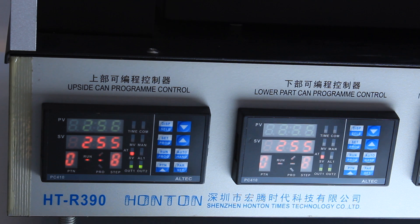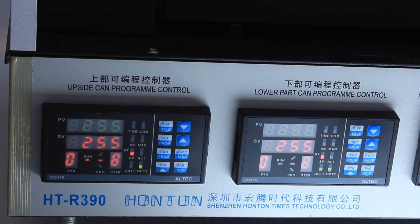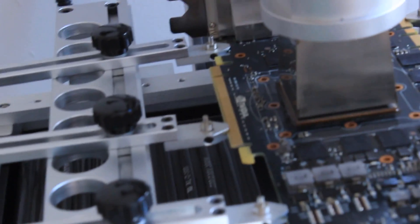At a nozzle temperature of about 255 degrees C we reach the liquidus temperature of the lead-free solder. At this point the GPU and the board are roughly at about 230 to 235 degrees C, which based on my tests I found is really necessary in order to ensure that even highly oxidized lead-free solder is actually being reflowed properly.